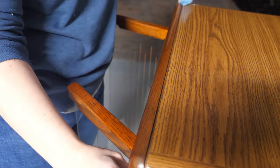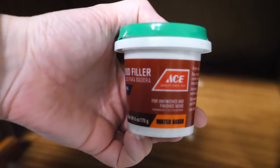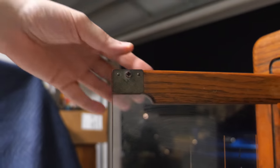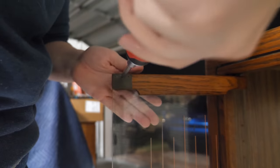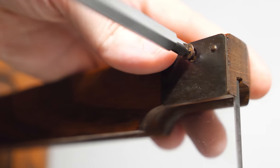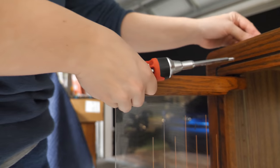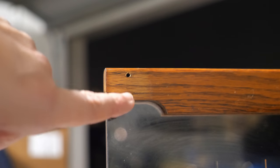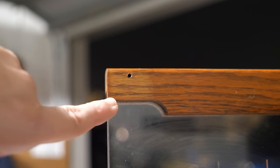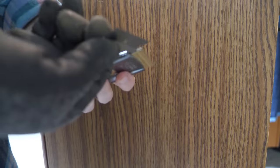After cleaning, I used some wood filler on the bottom sides of the cabinet where I saw some bubbling happening while cleaning, and I also filled four holes at the bottom of the inside of the cabinet. Next I removed the hardware. I wasn't able to remove the doors because they appeared to be pinned in between the cabinet during assembly. It's interesting to see how the cabinet wood has aged and darkened over time whereas the laminate has gotten lighter.